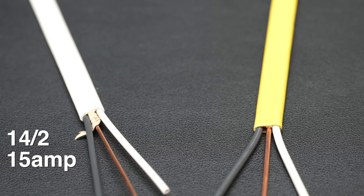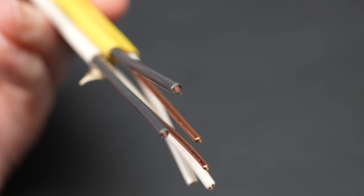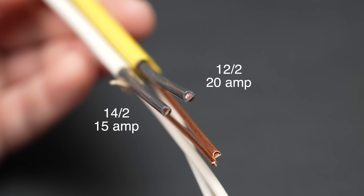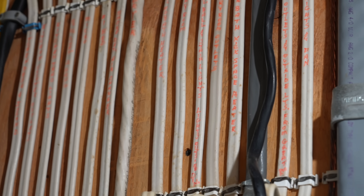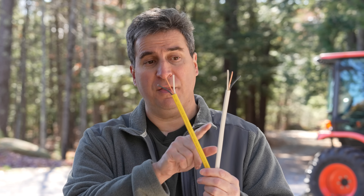Each wire gauge size also has an ampere rating. A 14-gauge wire in most circuits in your home is capable of carrying 15 amps. Many homes have a mix of both 15-amp and 20-amp circuits. The difference between 15-amp wire (14-gauge) and 12-gauge wire is extremely small — when you put them next to each other, you can hardly see the difference. So all these wires in just white look pretty much the same. Then in 2001, they introduced yellow wire, specifically for 12-gauge, so you could visually compare the two.